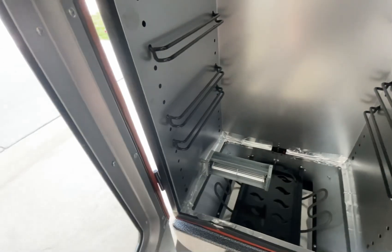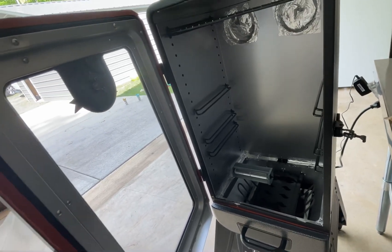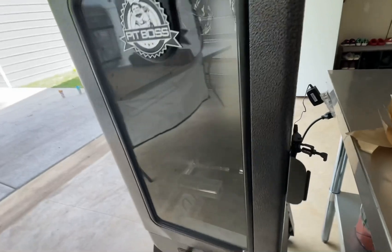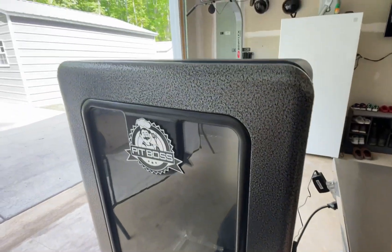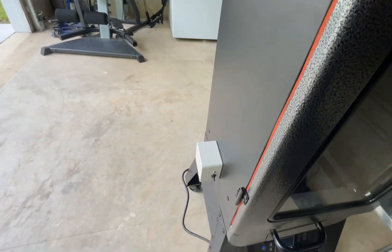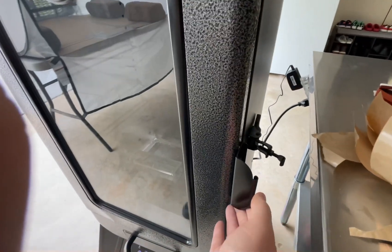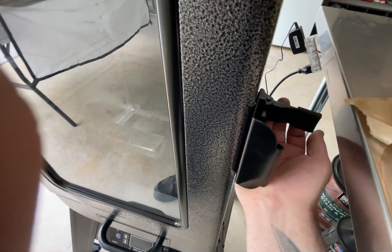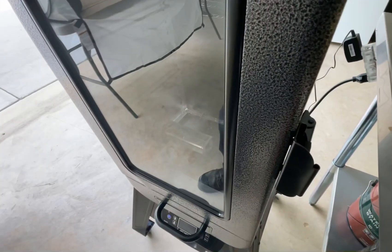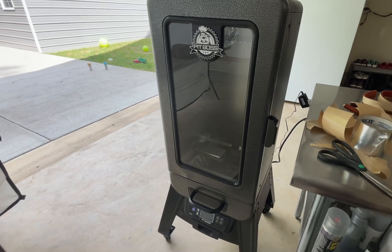Other than that, guys, that's pretty much it. We're really satisfied with how it came out. One negative: the door doesn't exactly line up, mainly because it starts to sag — there's just a lot of weight on the cheaper hinges. What I usually do is lift up on the door a little bit until it's about even, then go ahead and clamp it down. Hope y'all enjoyed the video — subscribe and like for more content later. Thanks.